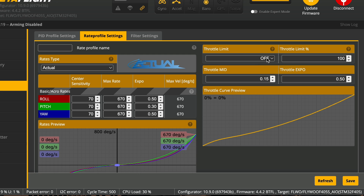One of the things I see a lot of people doing is scaling down their throttle limit from 100 to about 80 or even 70 in order to make their throttle the smoothest. Personally, I keep my throttle at 100% because I fly my drones inside and outside and I want to be able to use the full range of motion, but scaling it down is a good way to limit and make your drone a little bit smoother.